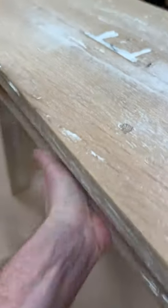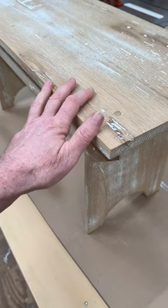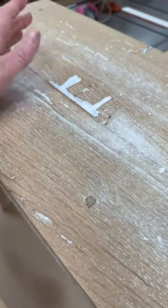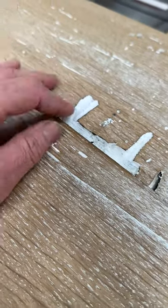Probably going to varnish this. I was thinking about spraying it with lacquer, but I don't want to use a waterborne finish because that just kills the life of the wood — unless you shellac it first. But you really shouldn't shellac over paint, so that's why I might varnish, which will warm up this very stark white colored paint.